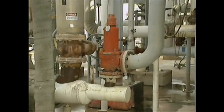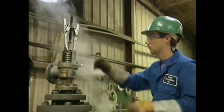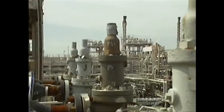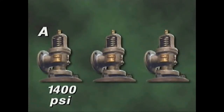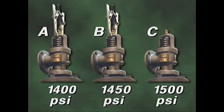Never apply a gag to a cold valve that will be heated — the valve stem expands considerably as temperature increases, and if the stem isn't free to expand, it will be bent. Never leave a gag on a safety valve during normal system operation, because a gag makes a valve inoperative and the system will be unprotected. Finally, when testing the popping pressure of any valve in a multi-valve system, you must gag the valves set to open at a lower pressure than the valve being tested. For example, if valves A, B, and C are set at 1400, 1450, and 1500 psi respectively, and you're testing valve C, you must gag valves A and B.